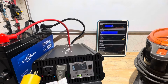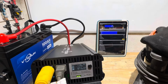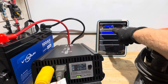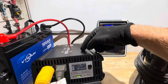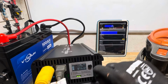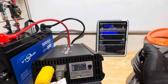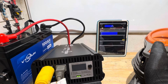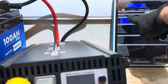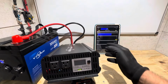Alright, so the vacuum works, less than 400 watts, so put the charger back on. Alright, so 965 watts coming out of the battery right there, putting out 870 on the AC side. So let me go see if we can get this vacuum to hit one more time. No, that BMS is super sensitive. Discharge overcurrent again on the battery trying to start the vacuum cleaner.